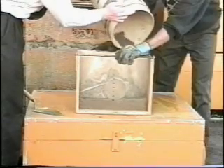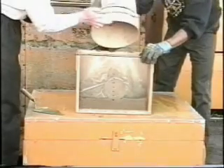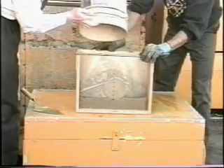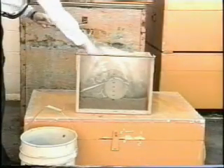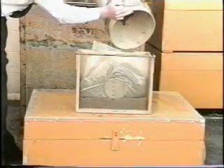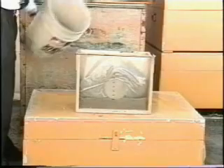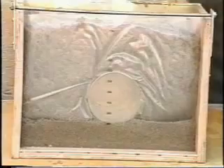For the second test, the can has again been laid on a bed of sand. This time backfill is placed around the can. It is dumped loosely and no attempt is made to compact it. This simulates a culvert which is being installed with poor quality or poorly compacted backfill. Backfill is placed to a depth of one diameter or 130 millimeters. Almost immediately a deformation of five millimeters takes place. This is due to the sand settling and becoming compacted.